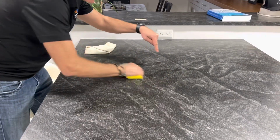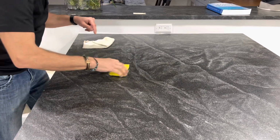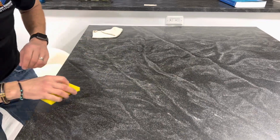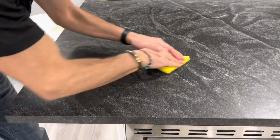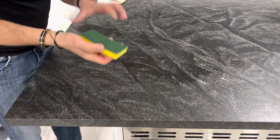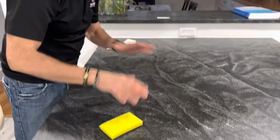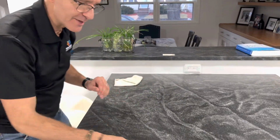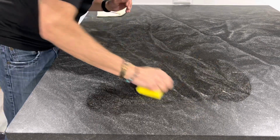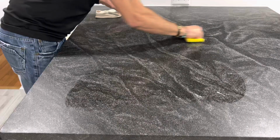We're going to do the scratch as well, and basically, with just, you know, the newer the pads, the kind of easier it is. That one, let's try to do this one over here. And don't be afraid, because even though this is a scour, this is granite and it's a honed granite. If it's a polished stone, never ever ever use one of these on a polished stone. You'll kill me. You'll tell me I misled you. It's only for honed stones, okay, whether it's a marble or a granite. Sometimes this happens on marble too.